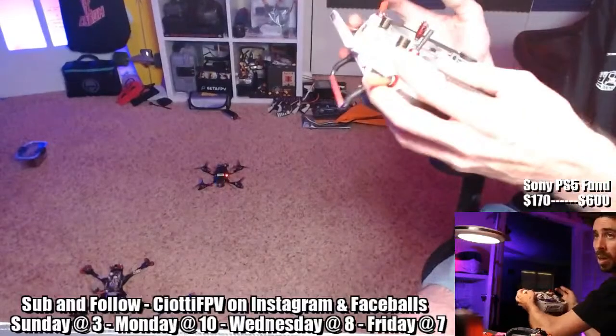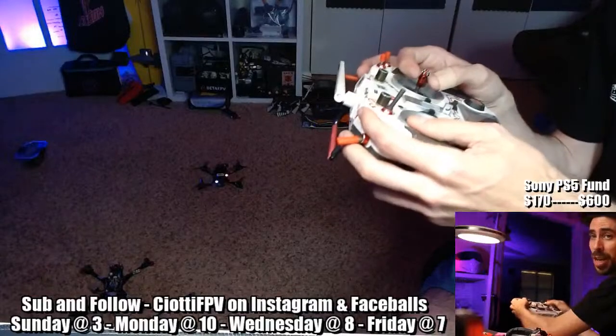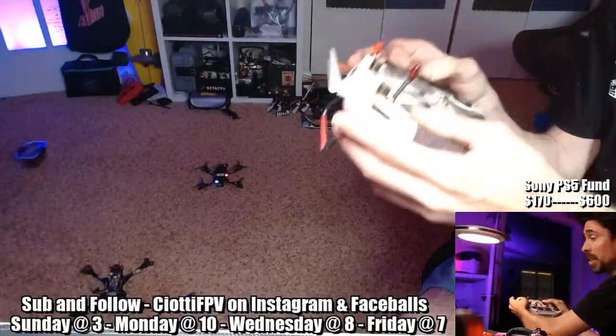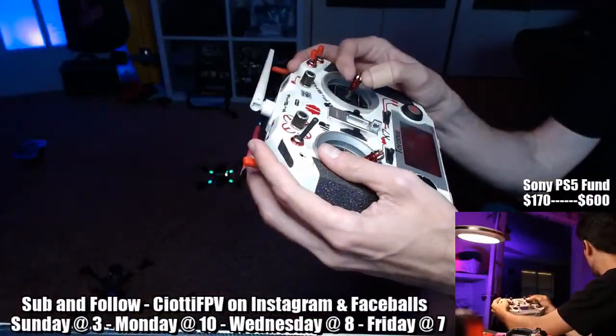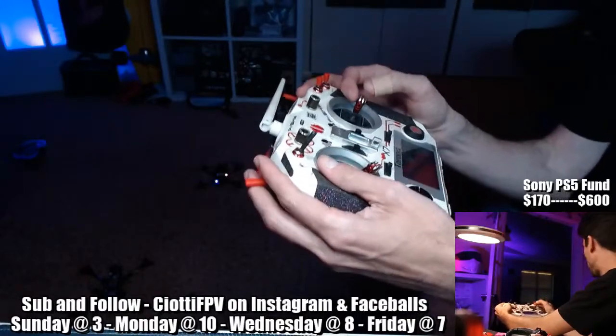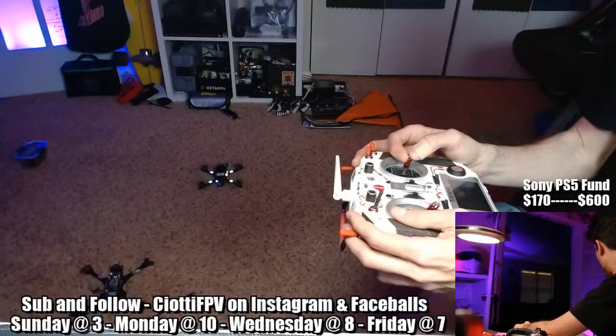Now we're gonna arm it, and we're gonna move the right stick only, and there is a chance that it could flip out here, so pay attention and be ready to disarm. So you're gonna arm it, and just bump the right stick and then disarm right away, just to be sure it doesn't go bananas. That was totally fine.